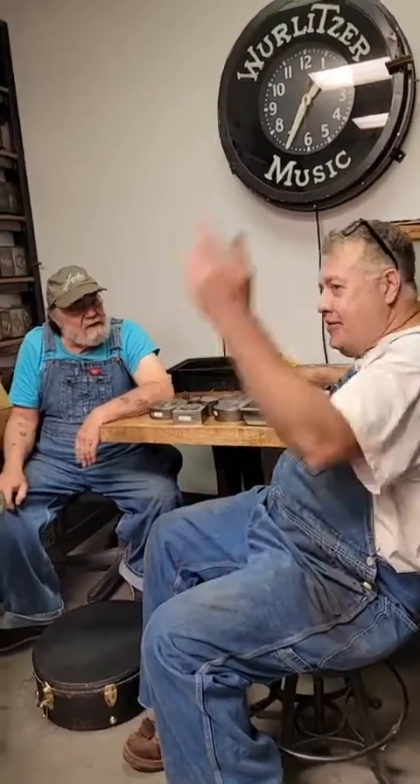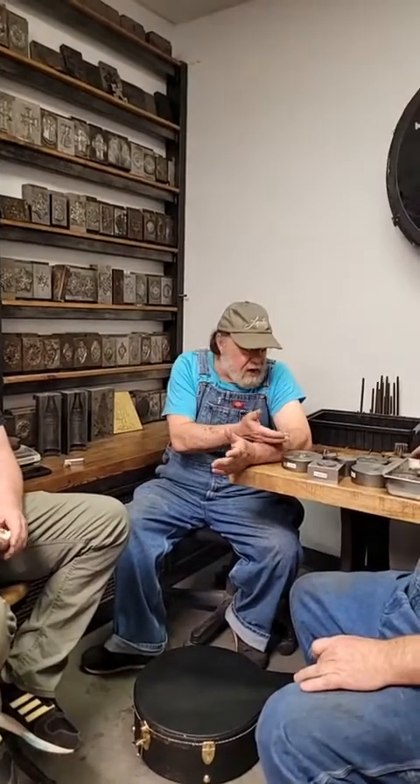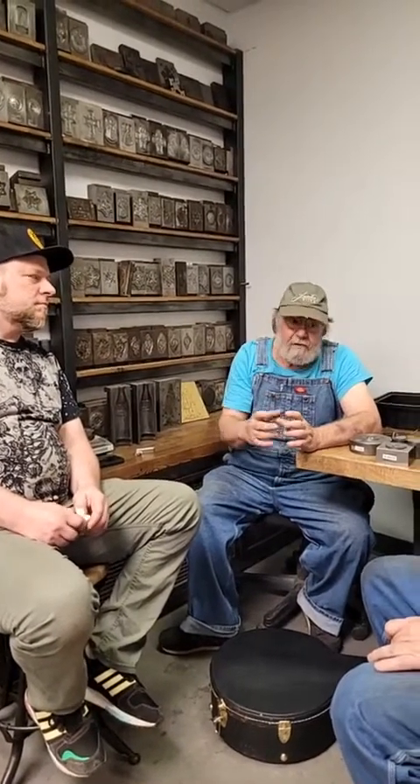None of this stuff was written down — there are no manuals on how to do it. It was an anti-counterfeiting measure; you didn't record it. I've been pumping Ron for information for years. It's so nice to have him out here because I can run ideas by him. With any problem there are probably several ways around it, and every shop probably had different methods. Each time you make a hub or a die, it has different problems with the way metal flows.